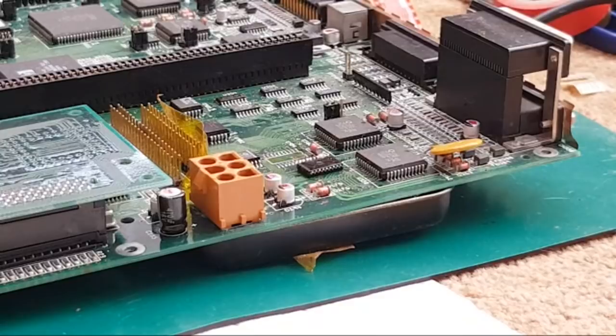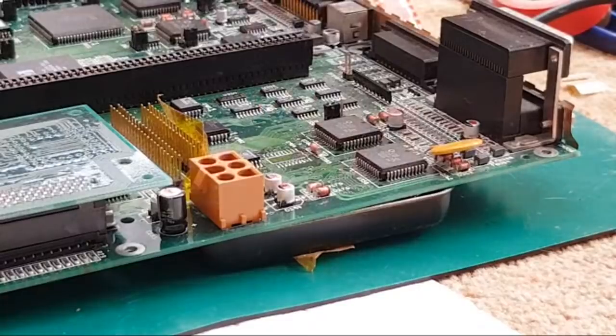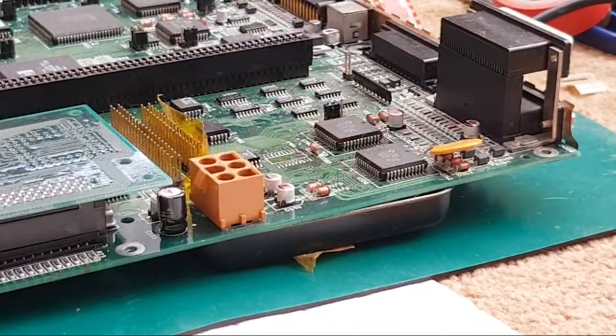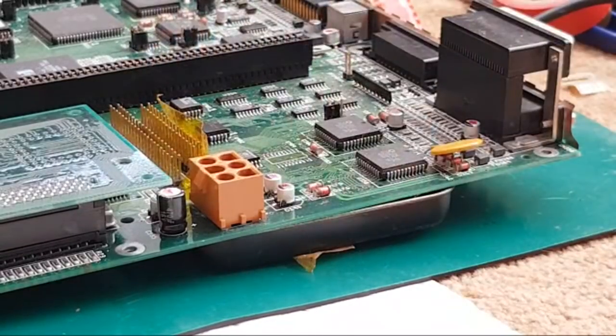Idiot Arana, what was the IDE issue? Dead or corrupt compact flash card? Yeah, I corrupted the compact flash card. That was what happened with that compact flash card. It didn't kill it by me probing a few things there. I simply corrupted it. And that was by probing pins D0 and D1 on the IDE connector there, while the board was upside down, when it was booting.